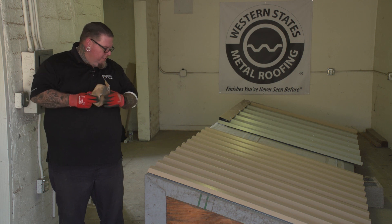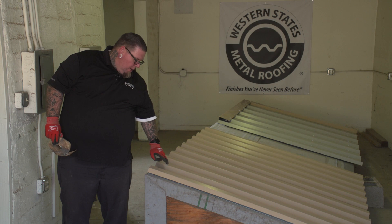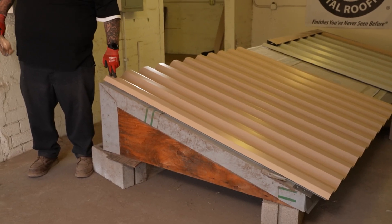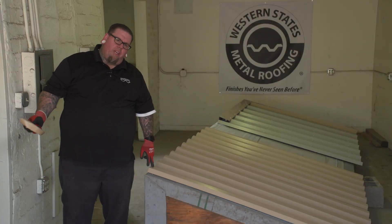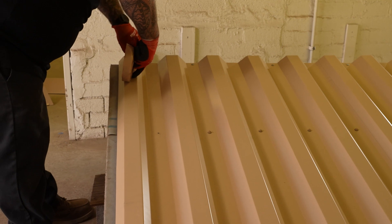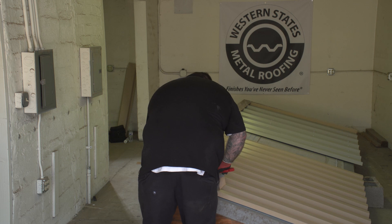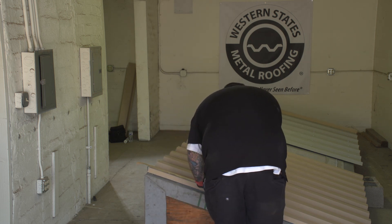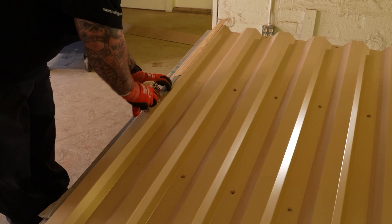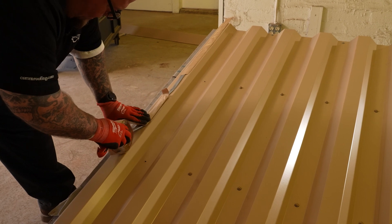On the top of this detail, the end cell or the gable side is going to connect over the top. We have to put butyl tape on this before we put the gable on it, and then we have to apply this to the bottom of the edge where we screw the gable to the actual roofing panels. Keep it in the center of the leg as best as possible and unroll it as it's going down. If it's cold outside, try to leave the butyl tape in the sun a little bit — it'll make it easier and more pliable.